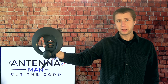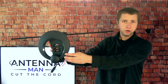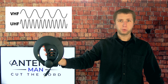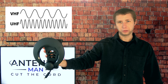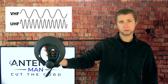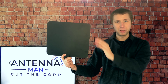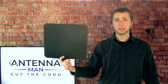Taking a look at this antenna it seems pretty good in terms of design with both VHF and UHF elements. VHF TV stations broadcast on channels 2 through 13 and UHF TV stations broadcast on channels 14 through 36. The different frequencies require different kinds of antenna elements to pick up the TV stations reliably. Most cheap flat antennas like this model do not have a long enough element to pick up VHF TV stations, which are present in nearly every television market across the United States and Canada.